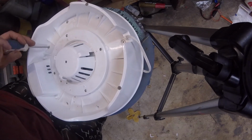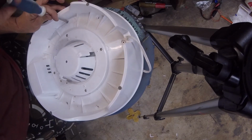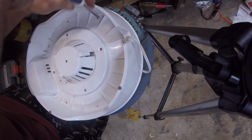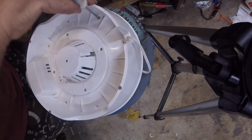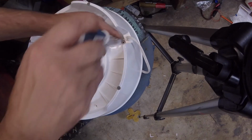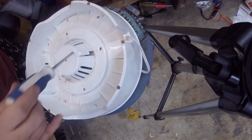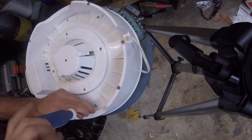So I put the filament in there and I dried it, left it in there for like 6 hours one weekend. Came out, put it in the machine. The machine kept clogging. I was like, what the hell? And took the whole hot end apart, wasted my time. Come to find out, it's little bulges from getting the filament too hot made it so it wouldn't go down the throat anymore.